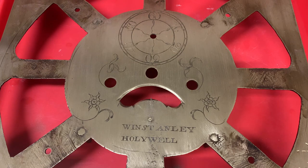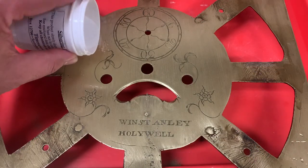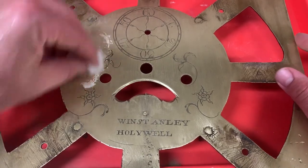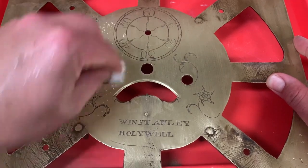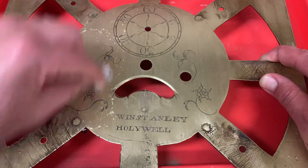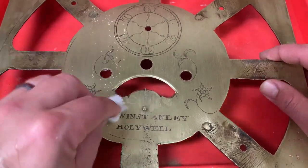In my last video series, somebody gave me a hard time for not wearing gloves. Gloves are great, but gloves were not used when this dial was first silvered in 1750. It really isn't a problem as long as you don't touch the final stage of the silvering before you coat it. My hands have been washed just a minute ago. If gloves make you more comfortable, more power to you. By the way, if you ever get confused which powder is which: silver chloride is the one that looks like table salt. The step two cream of tartar is much finer — it's more like baking powder. I'm going to rub this on here using just a little bit of water, using some friction to work the silver chloride crystals into the dial. We should see a very subtle color shift happening.